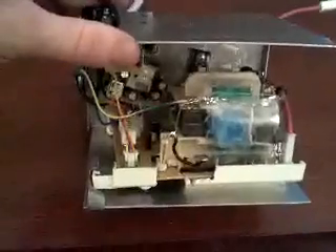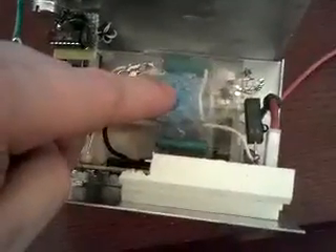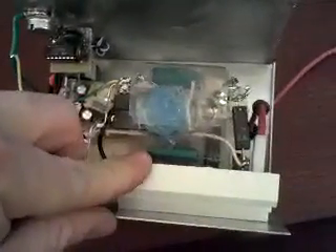This is the same inverter board that I showed you in the previous video, with a couple of modifications. First and foremost, I reconfigured the diodes on the output — these two diodes here are now in parallel with each other. They used to form a voltage doubler with these capacitors. I reconfigured these two capacitors to be filters across the output, and then I added a stack of 1 kilovolt 100,000 picofarad ceramic discs for some additional filtering. Between those three capacitor units, this thing has pretty good filtration on the output and is fairly smooth considering the 36 kilohertz switching frequency. I just have a little RF choke — a ferrite bead — on the output, and there weren't any other modifications to the actual circuit itself.